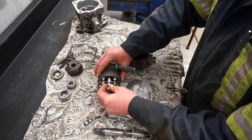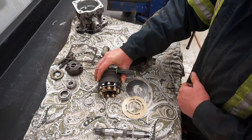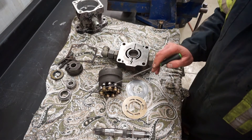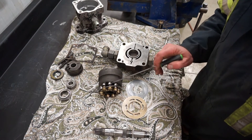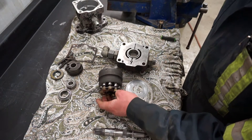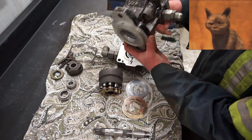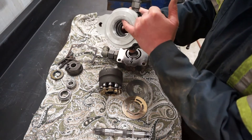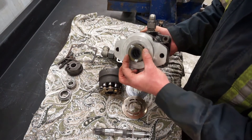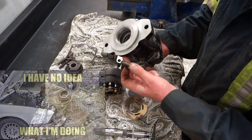It's actually still in pretty good shape. Keep your piston in the same hole in the barrel — in high quality pumps or motors they're hand fit between piston and bore. I doubt these are hand fit given the application and quality of this motor. For the housing, make sure it's still in shape. I did have to repair the outer seal surface — that's where it was actually leaking, between the outside of the seal and the housing itself. Someone had put the seal in badly and damaged the housing, so I had to sleeve it.